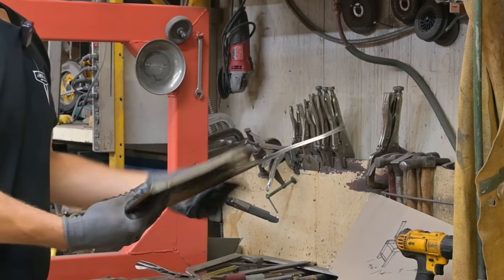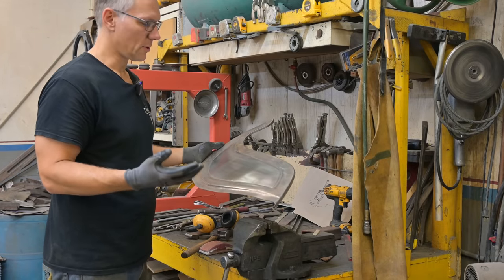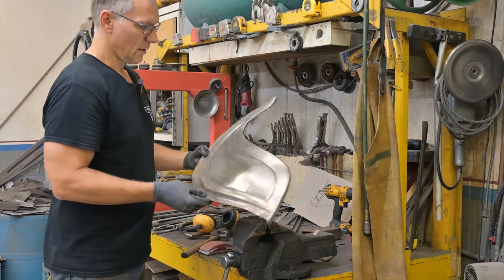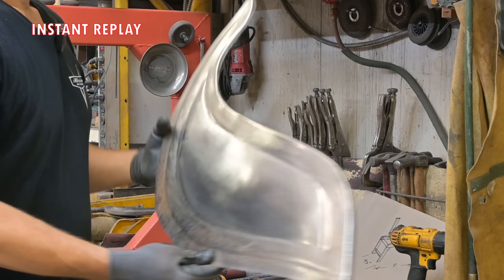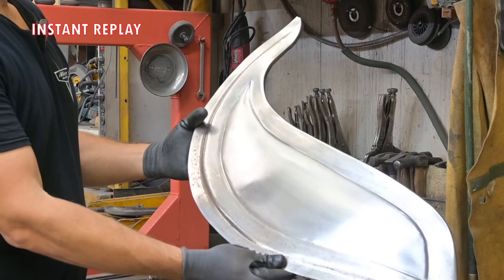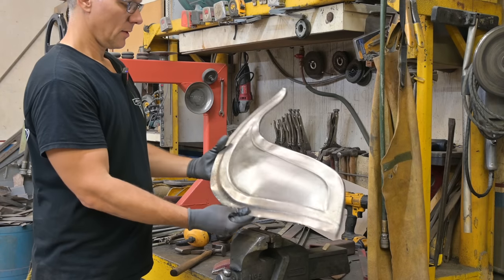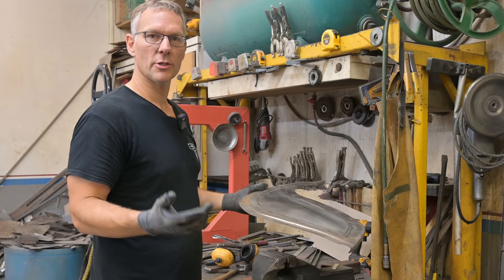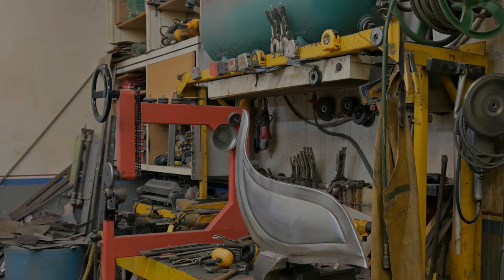Okay, I think that's all she wrote. There we go — don't be surprised if a repair like this could take several hours; it can take days. It just depends how bad the damage is and how far you want to take the panel in terms of the final repair quality. If you settle for a bit of bondo, you don't have to take it to this stage — nothing wrong with filler — but try to get as close as possible. But as you can see, all the reflections are tracking well, and we're good to go. So if you learned something and you like what you saw, hit that like button. If you're new to our channel and you haven't subscribed yet, please do — it helps our channel grow. If you have any comments or questions, throw them down below. Until next time guys, take care.